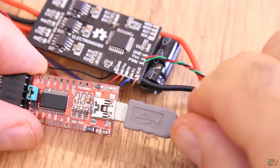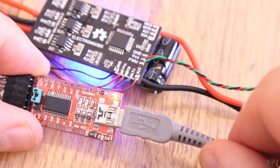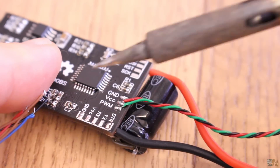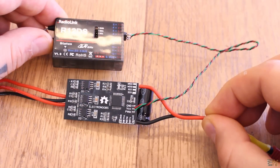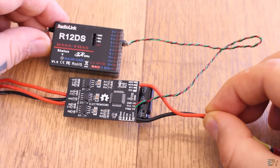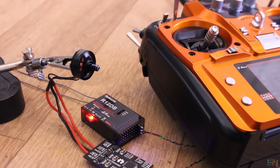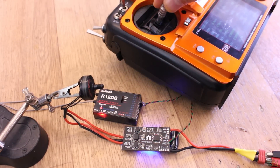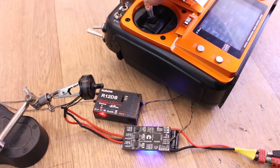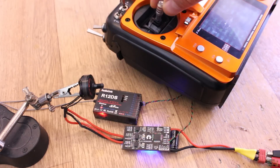I upload the one-direction code using the FTDI programmer. I remove the programmer wires and connect the receiver to the PWM pins of the throttle channel. When you power this up with throttle at minimum, the ESC will start in normal mode and you will hear the welcome beeps. If you don't increase throttle for a few seconds, you will get the standby beeps. Anytime I increase throttle, the motor will start — it is very responsive and will have a decent speed, so the control works quite well.